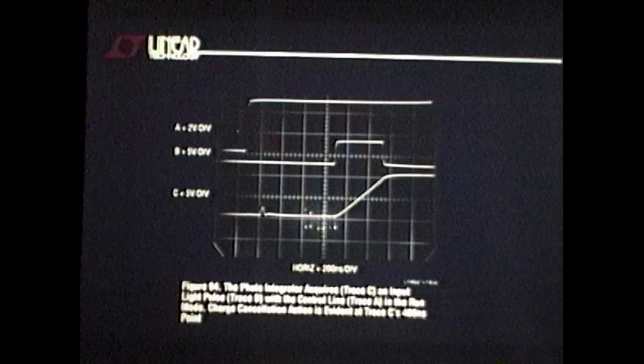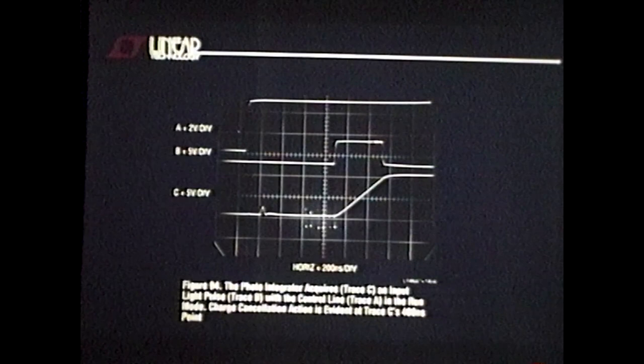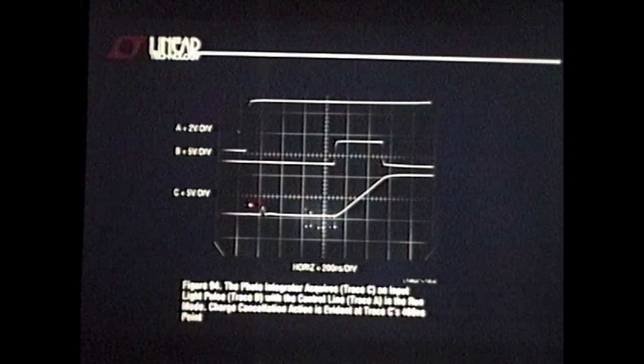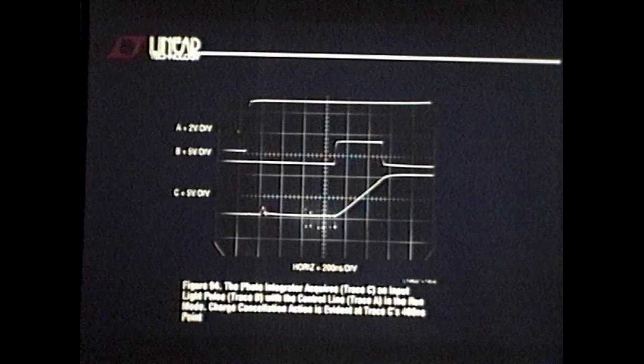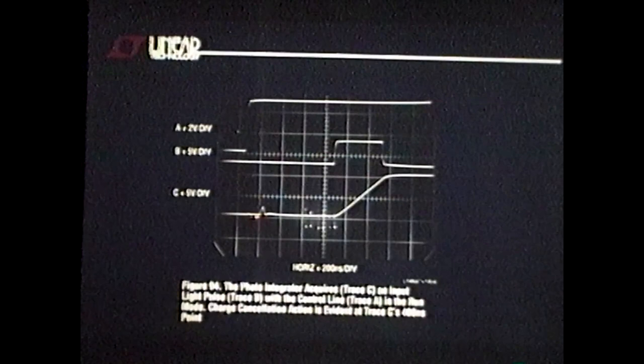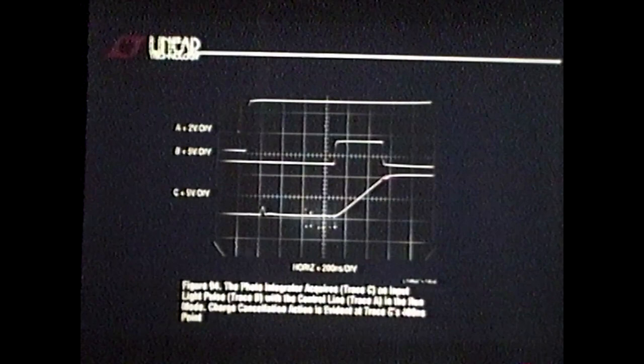Here's what it really looks like. We open the integrator switch expecting a light event. The light pulse comes along six or seven hundred nanoseconds later, but right here is the event of interest: where the parasitic charge from the FET switch and the charge compensator fight. You see a little blip where the two interact, the amplifier output moves around a bit, then settles back to baseline — the charge has been compensated. If that hadn't been done, this thing would have jumped to some elevated baseline and started integrating from up there, giving you a wrong answer.